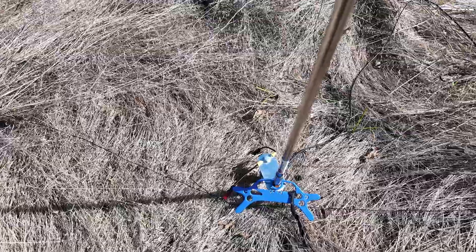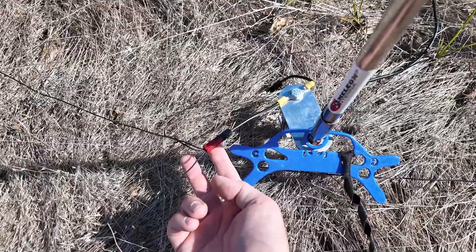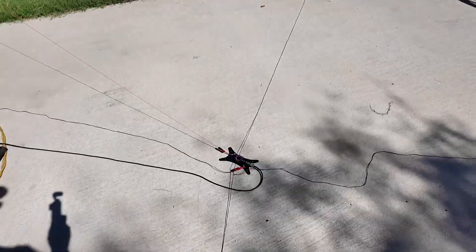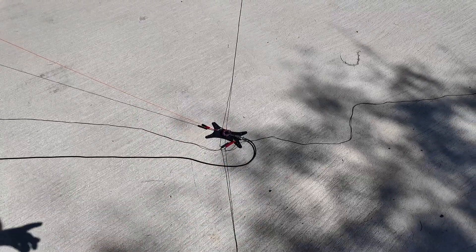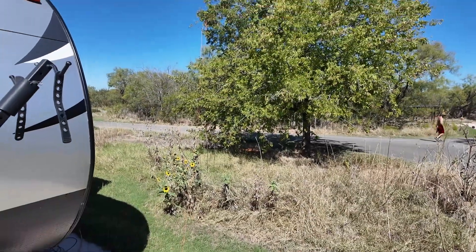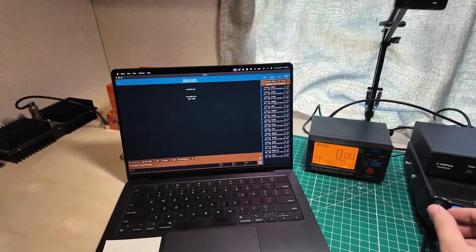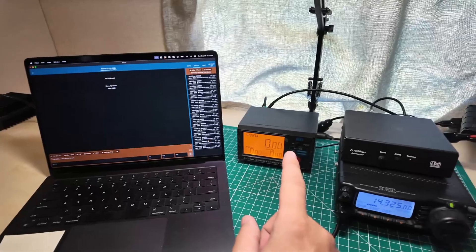For example, this is a 17-foot whip on a ground spike, and there are my ground radials. I'm going to steal these ground radials and put them on the Ares and get that up in the air. Let's see how this works — we've got four counterpoises going off in four different directions, the coax going off in another direction, and the antenna going up into the tree.